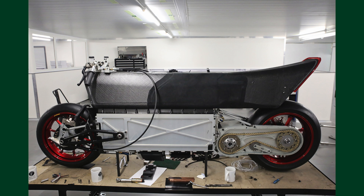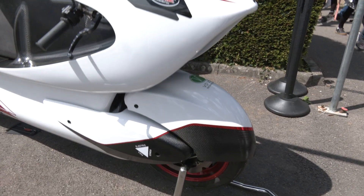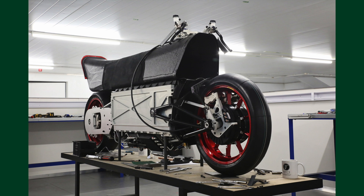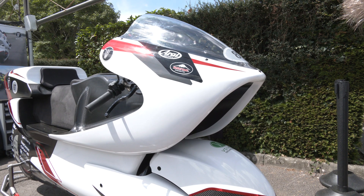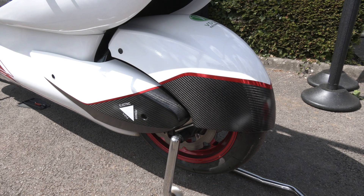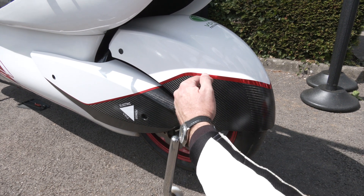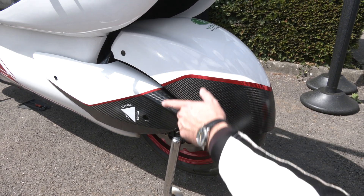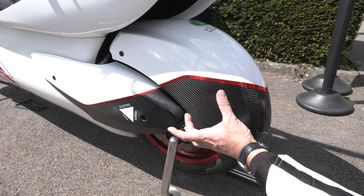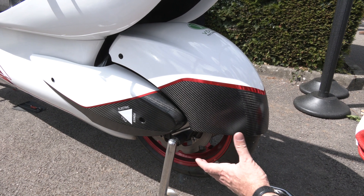On the front we've got quite a complex piece — we don't want any front forks for our aerodynamic concept, so we got those out of the way and we run hub centre steering down from the top of the bike and inside the front wheel. The headstock axis is straight in the middle of the wheel, the rake is controlled by a top control arm, then there's a twin spar front swing arm with the headstock in the centre, two wheel bearings on the outside, and on the outside of that we're running two 20 kilowatt motors and two 340mm discs.